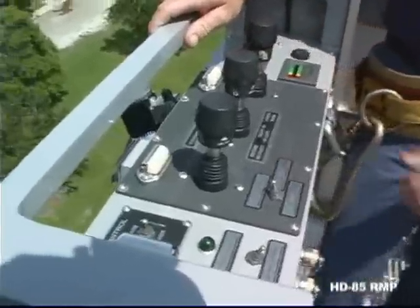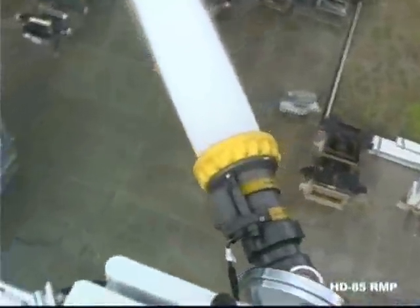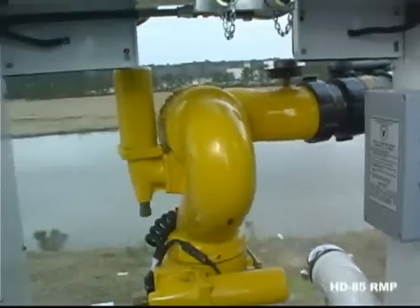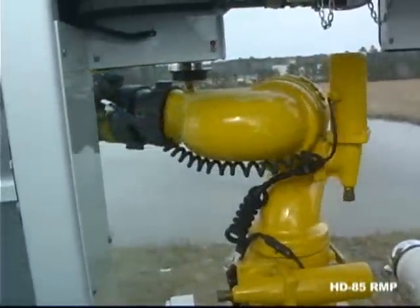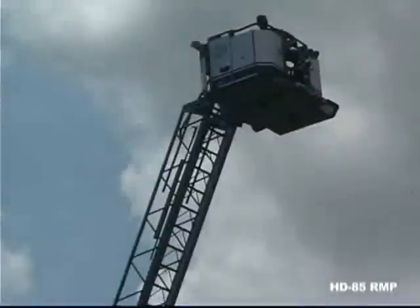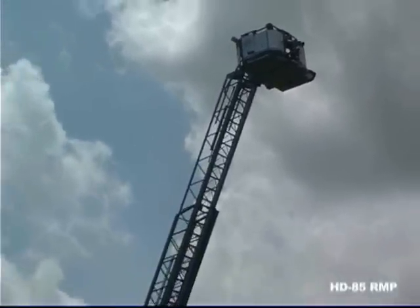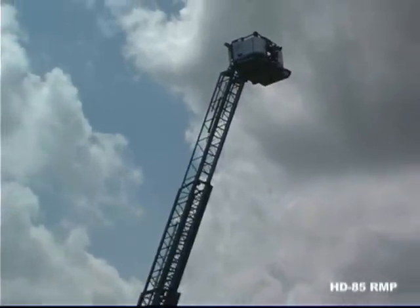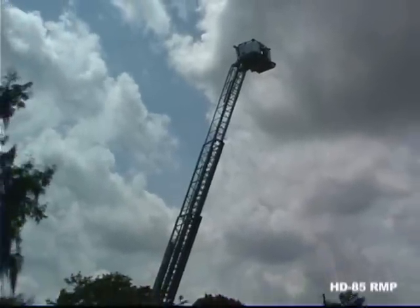Working from the basket to the ladder, you have an extremely wide 32 inch opening. All platforms are designed to flow full waterway capacity with the monitor in any configuration. The monitor travels a full 180 degrees, 90 degrees to either side. You control the monitor at the platform and turntable control pedestal. Flow 1,500 gallons per minute from the waterway with an unconditional 500 pound tip load and 2 to 1 safety factor.